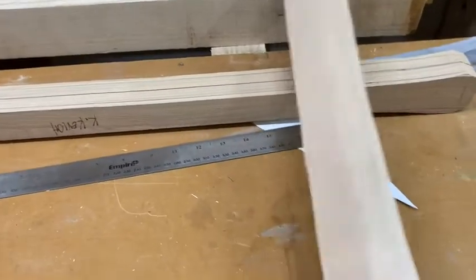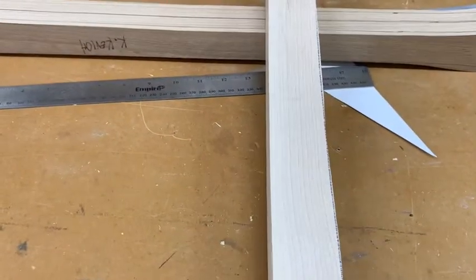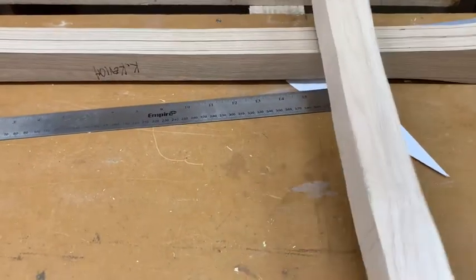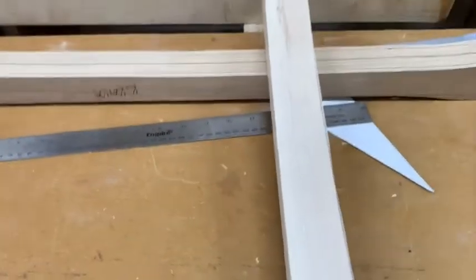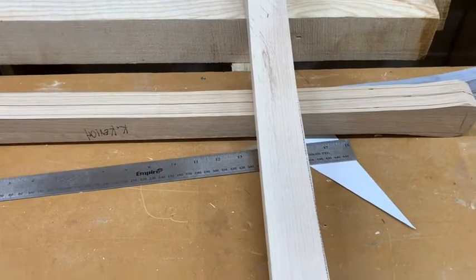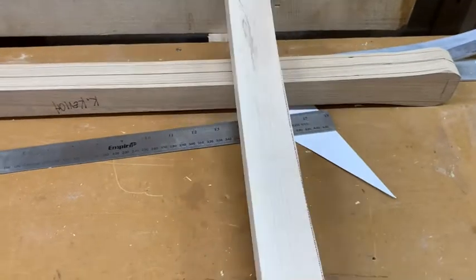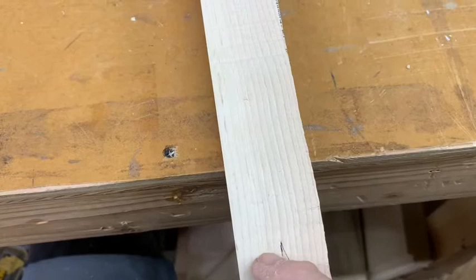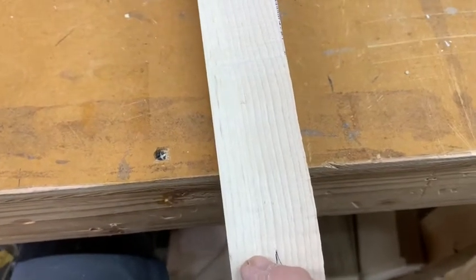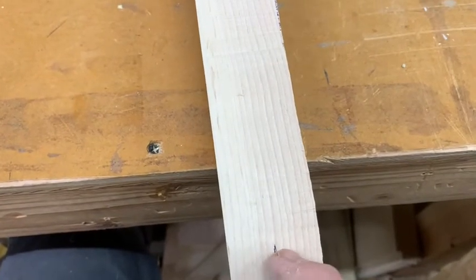And we'll turn it over and we'll do the same thing. Doing it on the bottom, if you're going to run this through a bandsaw or sanding or however you're going to be removing material, even with a rasp, it's going to let you know how much, by the time you put your marks on for your actual handle rough. In other words, if I want, say, an inch and an eighth, that would be 9/16 either side of this center line.